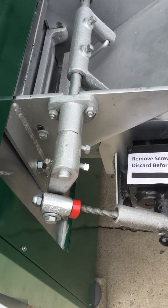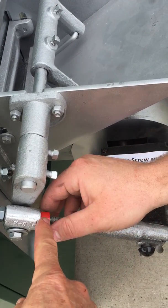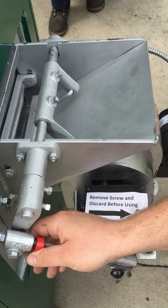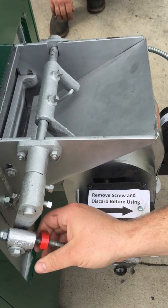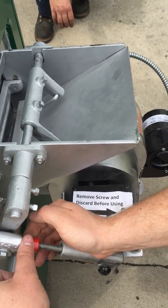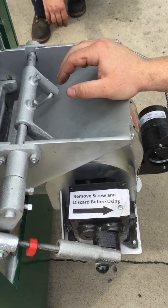Sometimes you have to move them up depending on how well the coal is burning. You would tighten that all the way and then 12 rotations out — so you're backing it off 12 rotations from being tight against the arm there. And how I always usually do is tell them the rule of thumb: when you can get your thumb in there, it puts you in a ballpark of where you need to be for coal feed.